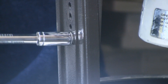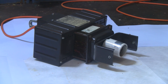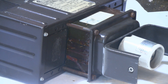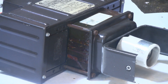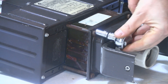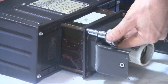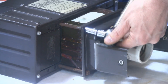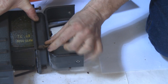Now there are four bolts that we need to remove. You can see them at each corner where the light socket connects to the ballast — there's a bolt at each of the four sides. I'm using a ratchet. Even though these bolts look rusty, they come out pretty easy and aren't in there too tight.